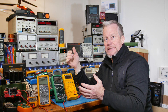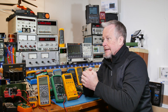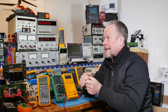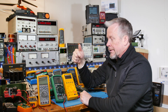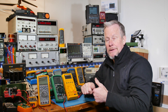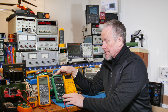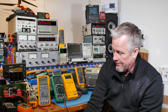There's also the energy in a transient. If I'm outdoors and a lightning strike hits a telephone pole down the road, I could get a surge into my test equipment. If I'm sitting here at the bench, it'll be a lot lower by the time it gets through. So you've got three things a meter is designed to protect against: the potential fault current, the voltage level, and the transient level — voltage isolation for both voltage and transient, and the proper fuse for fault current.